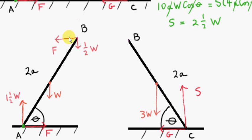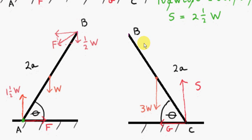So if we knew what F was, we could get the force on the rod at B due to the second rod. We could get this contact force. We could sum these two vectors, so we'd see it's pointing in this direction. Now we can go to our second rod. So we have the force on the first rod due to the second rod, this contact force here. So by Newton's third law, we have to have an equal but opposite force on this end of the rod.